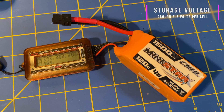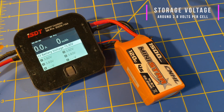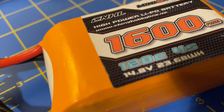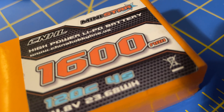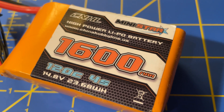The first thing I'm going to talk about today is storage voltage. When you get a new LiPo battery, it'll already come partially charged — not fully charged and not fully drained. This partial charge is called the storage voltage, and storage voltage is where each cell is charged to approximately 3.8 volts. The reason your batteries should be at 3.8 volts per cell is because that's the most stable voltage. Any more or less energy in each cell can cause the battery to slowly degrade and lose efficiency. This is also why it's important to charge or discharge your batteries back to storage voltage after using them.